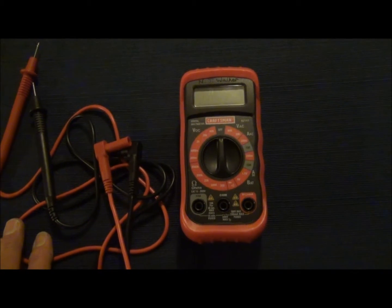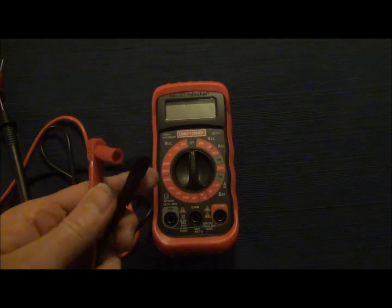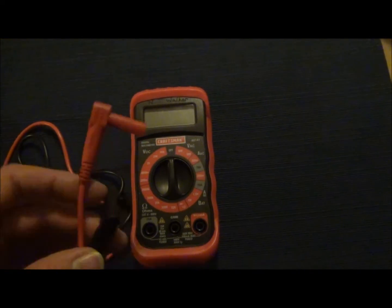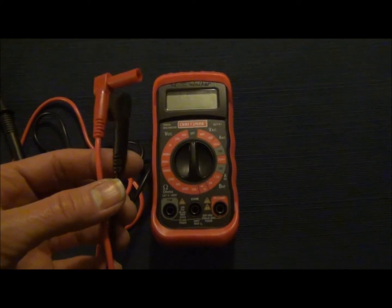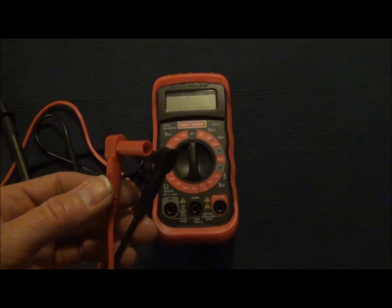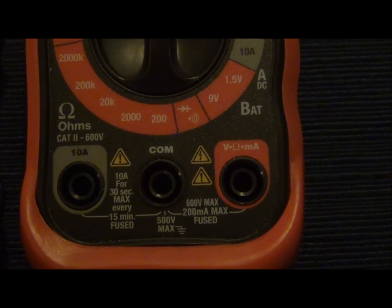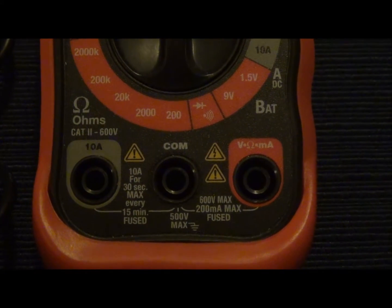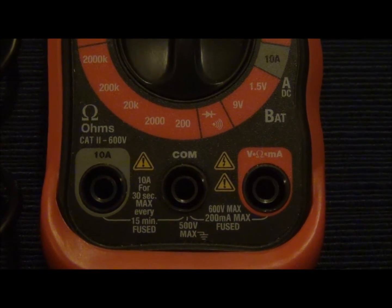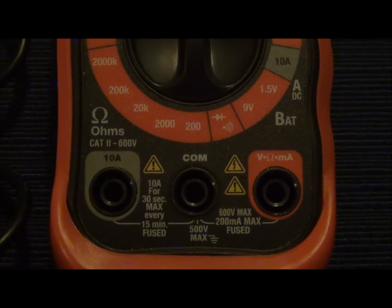The multimeter should be in the off position when you obtain it. We've got two ends with the caps removed. It really doesn't matter which color goes where — red usually denotes positive, black usually denotes negative, but the coloration is just insulation on the wire. We're going to place the black one in the gray port since I want to measure current. It says 10 amps. I will also use the comm port with the red wire. When I wish to measure voltage, I will switch — the 10 amp lead will go into the voltage or ohm reading on the right.